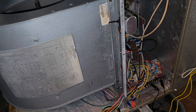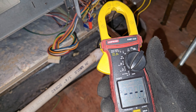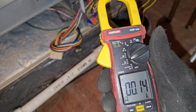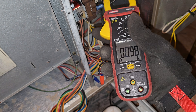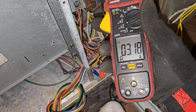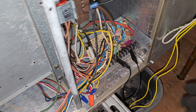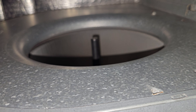Let's see what sort of amperage draw I'm getting. Four amps is the motor FLA. I'm reading three point one — good. Rotation is good.